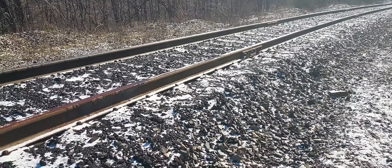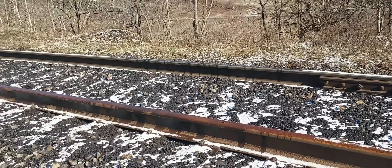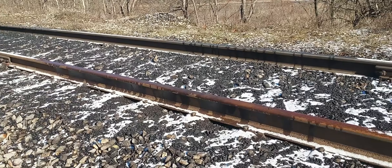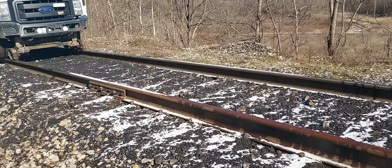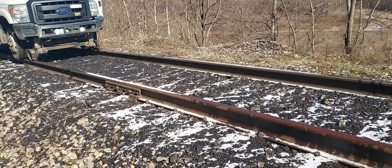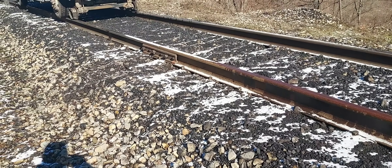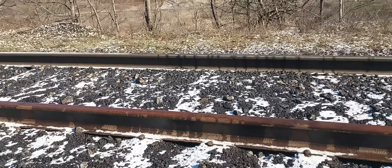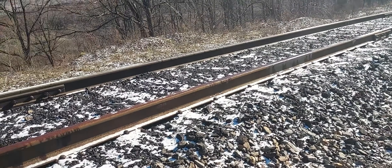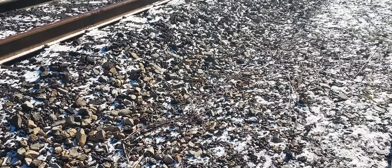The Code of Federal Regulations — we have Class II track here with 25 mile-per-hour track speed. The Code of Federal Regulations does not require Class II track to have ultrasonic rail inspections done. But we do it. We get the ultrasonic rail inspectors in here twice a year, and that's just awesome. It's not something we have to do, but it is very definitely a very important safety thing. We also get a geometry truck in here once or twice a year. That's wonderful too, but the geometry truck is different than ultrasonic rail testing.